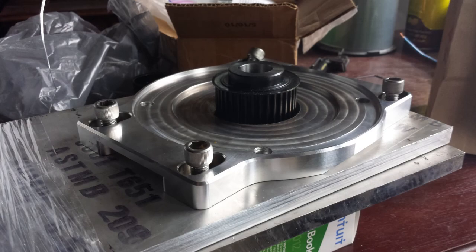This here, I'm just flattening a side that I accidentally made, and when I cammed it, I actually made it like an arc instead of a straight line. All in all, everything turned out very well. The spindle motor didn't stall, but I wouldn't expect it to in aluminum at 3300 RPM.